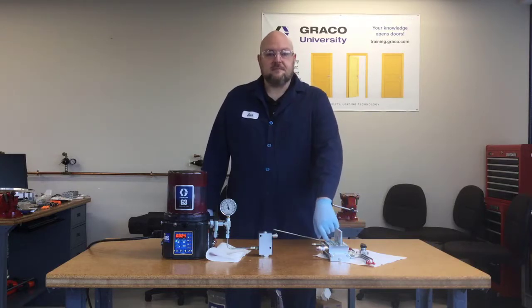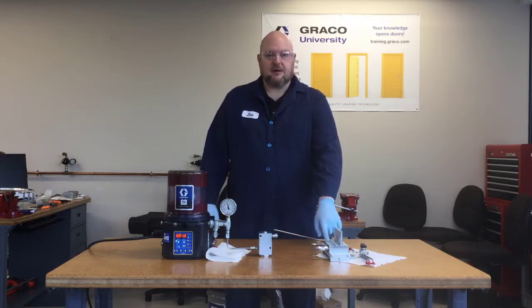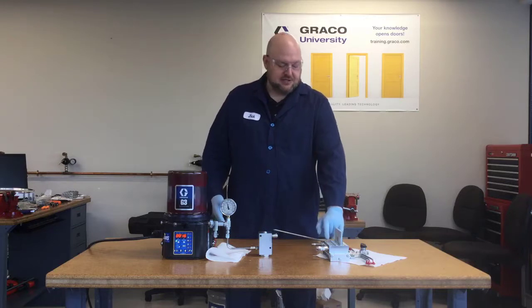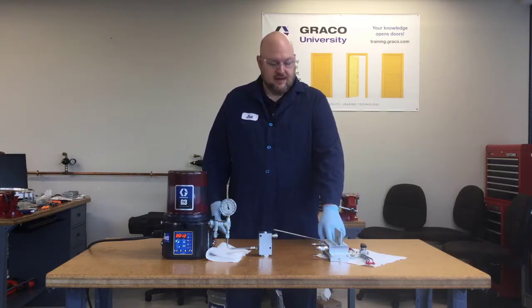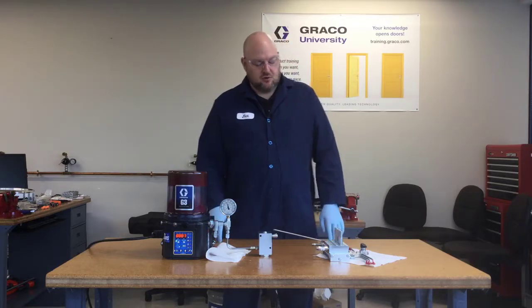So they would just need to be loosened and re-tightened a little more gently. It's less than 10 foot-pounds, which, when you think about it, is a very tiny amount. It's really just because you have straight threads here and O-rings to seal the valves against their bases, so they don't need a lot of pressure just to tighten up those O-rings a little bit.